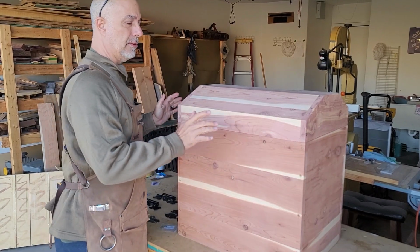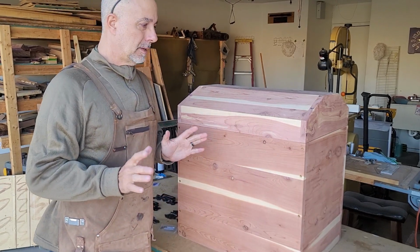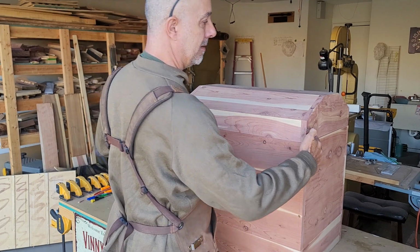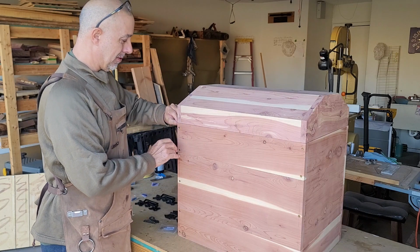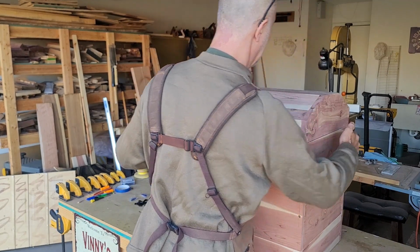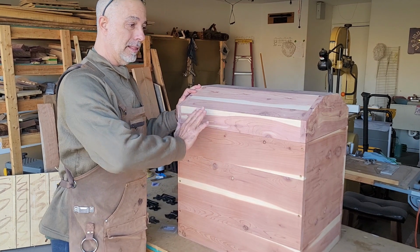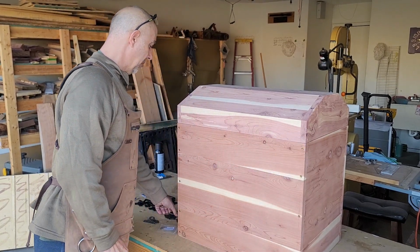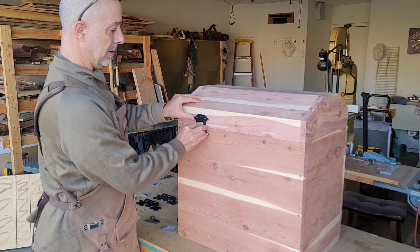The first step is to put your lid on exactly where you want it. Unless you are an incredible craftsman at this point, like I am not, the lid is not a 100% perfect fit. There's maybe a 32nd to a 16th of an inch of overlap here and there, so it's not perfect. Get it where you want it first, because once you put the hinges on, you're not going to be able to move that, and then the lid's going to have to open and close based off of that. So line this up exactly how you want it first. Once you get that there, don't move it again, and put your location for your hinges. At least mark those up.